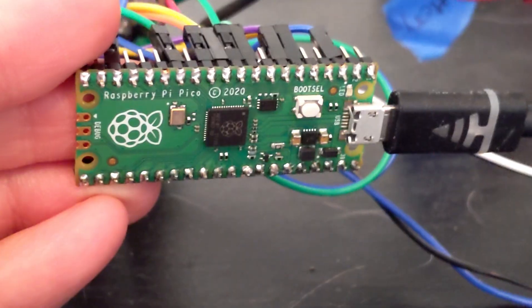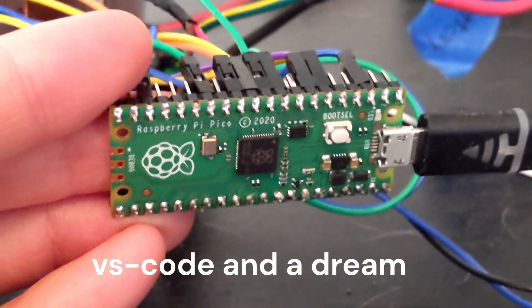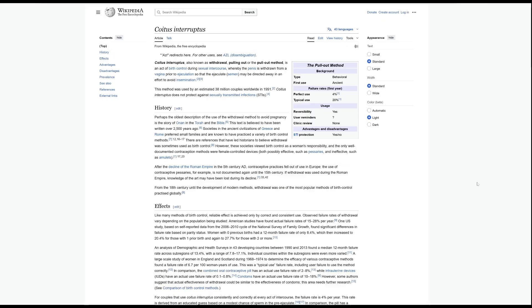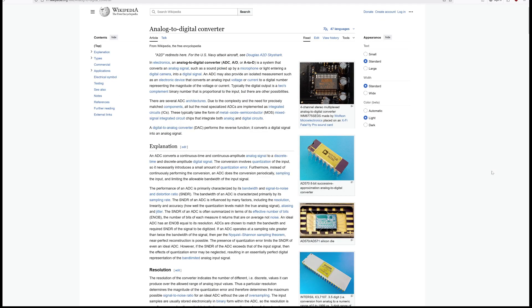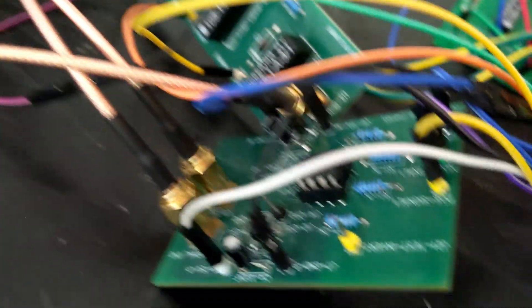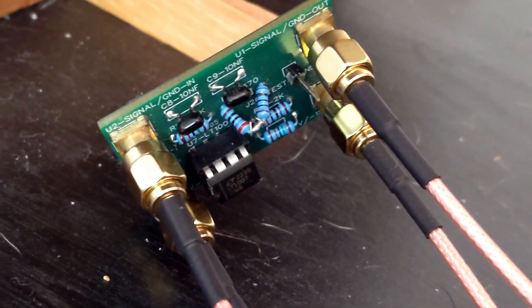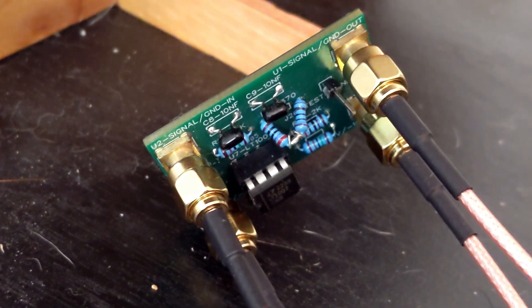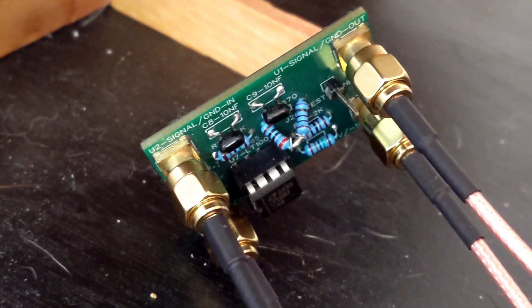The microcontroller has been replaced by a Raspberry Pi Pico, and the codebase has been wholly rewritten — we're talking direct memory access, interrupts, ADCs, and a buffer. Each op-amp layer is on its own board, so if something needs to be improved, I don't have to take apart the whole thing — I can just swap that board in and out. Similarly, the op-amps are sitting on carrier inserts, which means if I need to swap them in and out, it's easy, and I can reuse them whenever I need to.